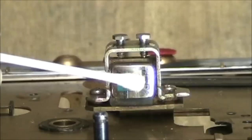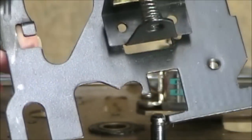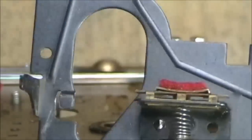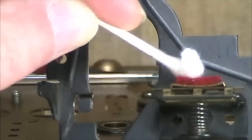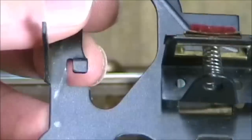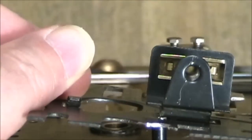If you see anything on the erase head it's not that critical, because the erase head is not doing sound recording — it's simply realigning the magnetic particles on the tape. There's a transport plate that moves forward and backwards relative to the head, pressing the tape against it. You can see it here with this brass piece carrying a red felt pressure pad. The red felt is a replacement — the original had what looked like little moth holes, so I took it off and replaced it with piano felt.